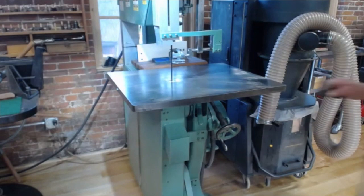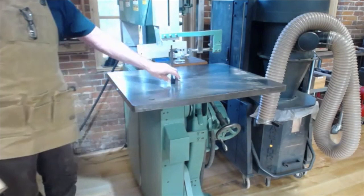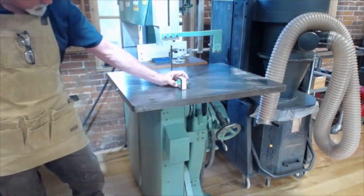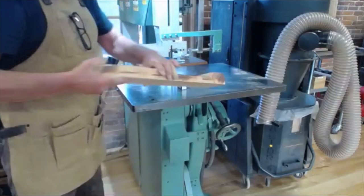Where the best spot to set this up is. I make sure that my blade is pretty square. This is always subjective, I guess. It's pretty square. And then I put my digital level on, zero it. And because I have 3 degrees cut on this edge, where are we? This edge. 3 degrees, 3 degrees. I adjust my bandsaw so that's 3 degrees.